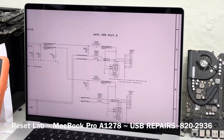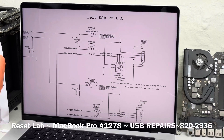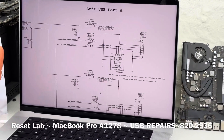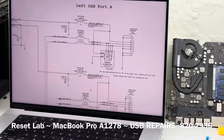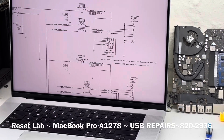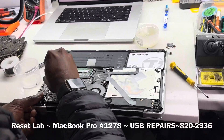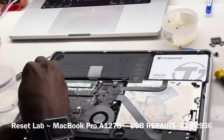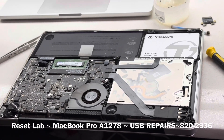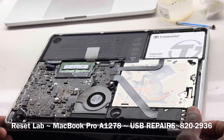In this particular case, our problem was L4600 and L4610. We replaced both and now we have USB function. That solves the problem of USB not working on this device. We're going to clean it up. You can use the flat design or the raised design. This is a 2011 board but you can use a 2012, and you can even take the component from a 15-inch — it's still going to work. And that's it — see you guys in the next one.